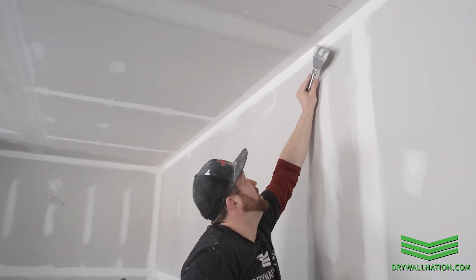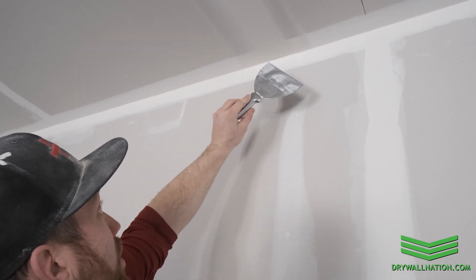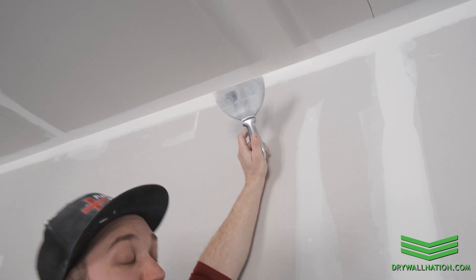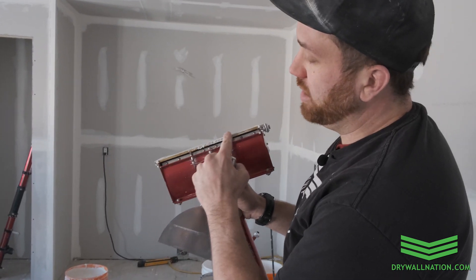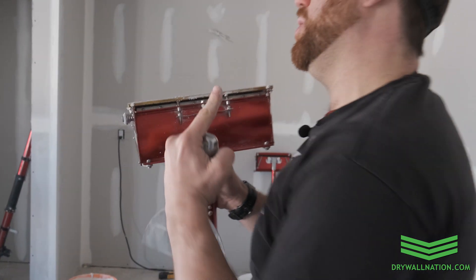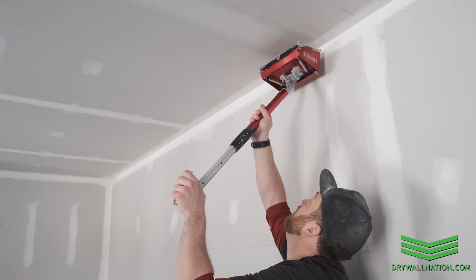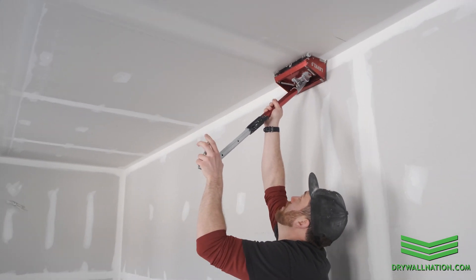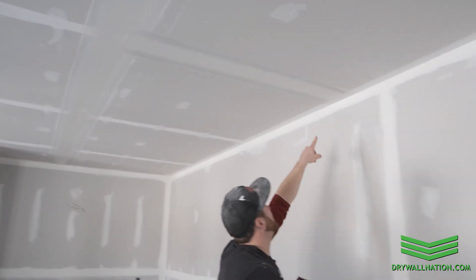This is what I refer to as a Christmas tree — you can see the drags right at the start of the run. That's most likely because I was pushing a little hard at the start, causing the mud to fold over the back of the troweling bar, and as you move forward that excess mud gets dragged. If I very lightly go up to it and pull without pushing too hard, you can see those Christmas trees are a lot smaller.